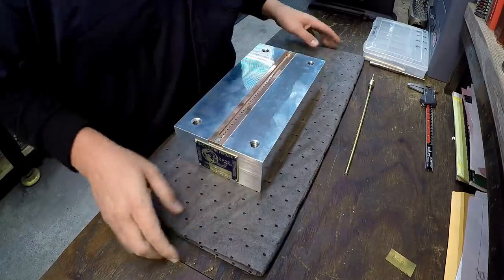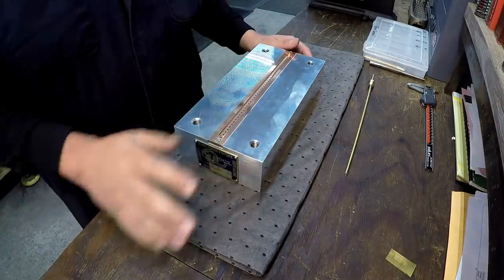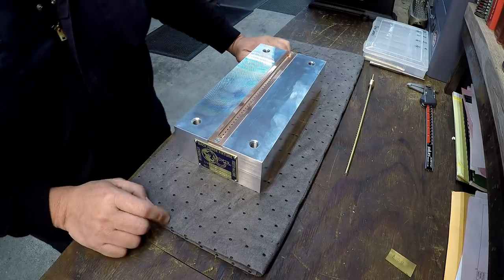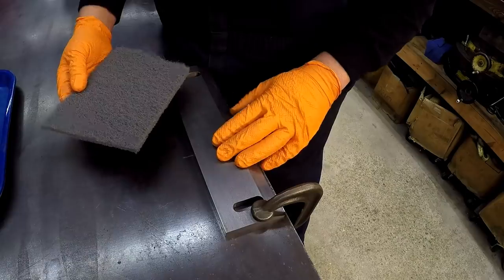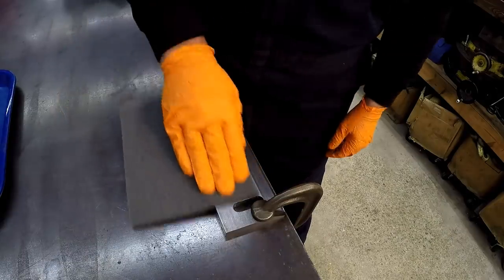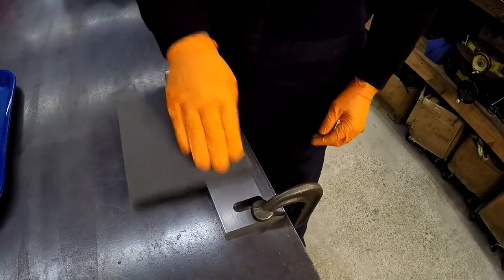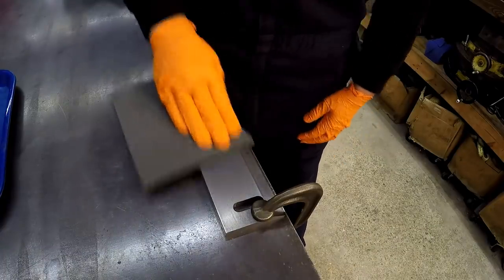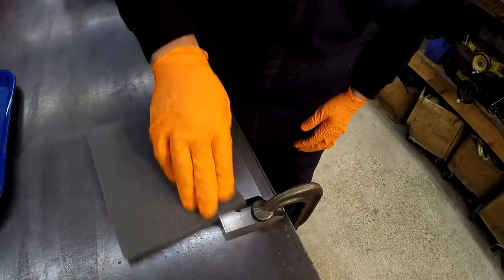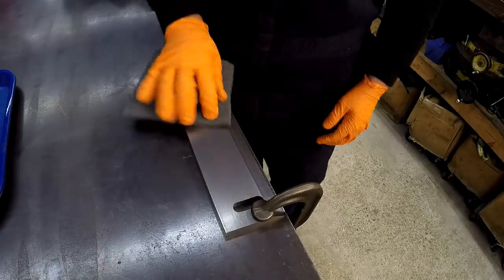All right, so we're getting close. All we need to do now, let's go over to our clamp bars and go ahead and do our OSFO black on those. The two clamp bars, to prep them, all I'm going to simply do is clamp them down here, and rub them down with this Scotch-Brite just to kind of buff them. Just like so, we'll do that on all sides, and I'll clean them real good, make sure they're good and dry, and then we'll go to our OSFO black.